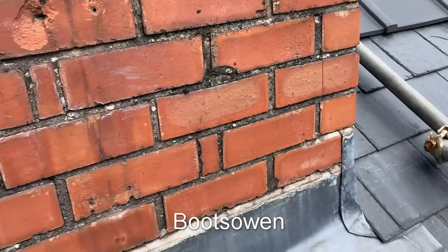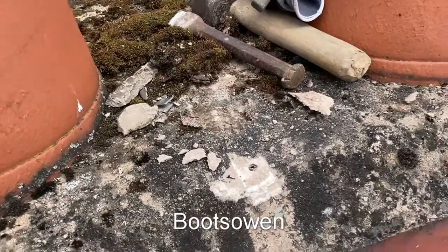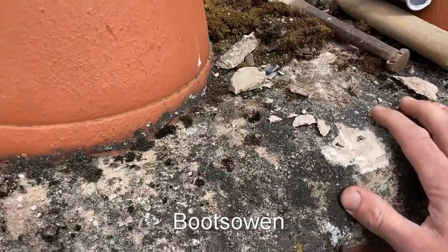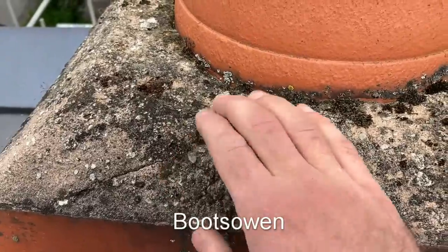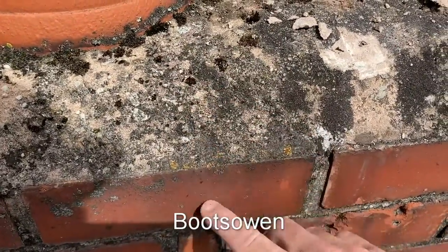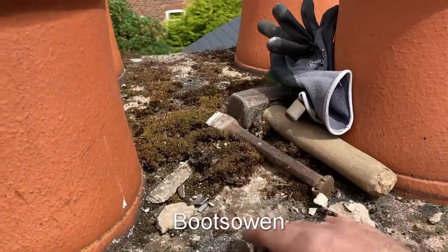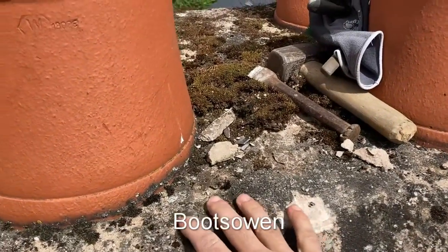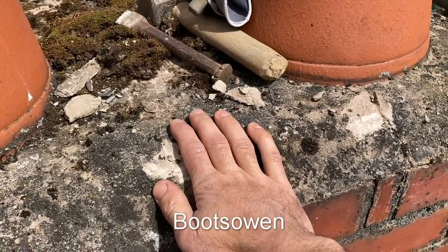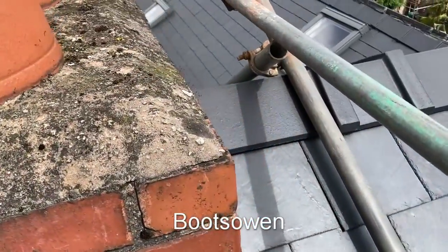There's a cracked brick over there but I'm not too worried about that. The other thing I noticed up on top is that the mortar or capping here is really solid with some movement in it. These cracks were here five years ago - there's a crack there out from the chimney, a crack here - that's expected because it's the narrowest part. But what you'll notice is there's no drip here, and on top it's pretty much like a table with no fall from the center outwards. I'm going to chip away anything that's loose, clear off all this moss, and then apply what's called flaunching - with a little drip out on the edge.